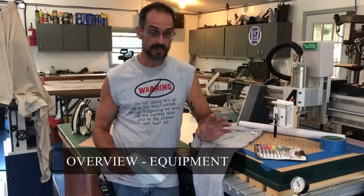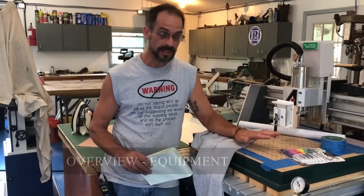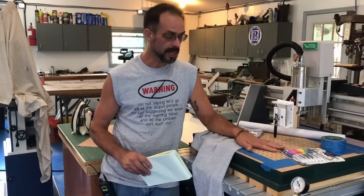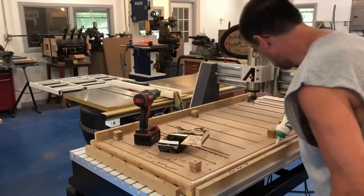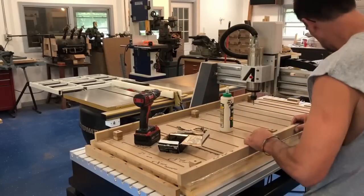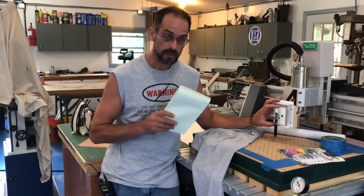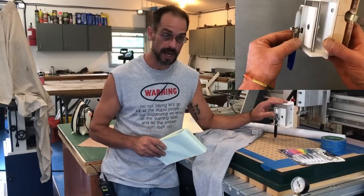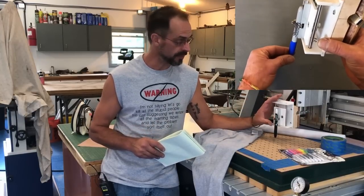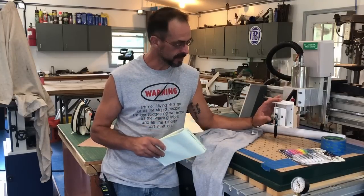First I'm going to give you an overview of the whole process. You have to have a couple items with your CNC machine. First off, you're going to need — and this is critical — a vacuum table. I built my own. There's lots of designs out there, but I'll have a link in the description box. You're also going to need an attachment to hold your fabric marker to your CNC machine. I have a video outlining four different designs I've built — link in the description box. But you're going to need a way to hold the marker.